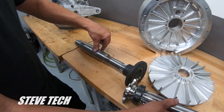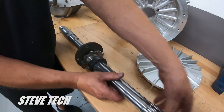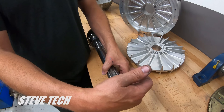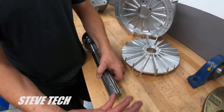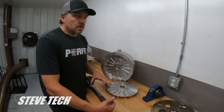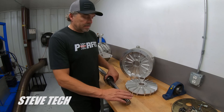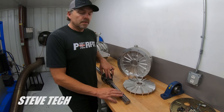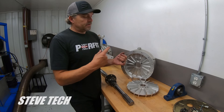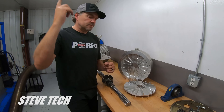So this is where the rotor goes. The rotor goes here, bearings right there, and then this basically goes here, and there's a flex plate right in the way. Then on the motor side, we don't just run a regular flywheel on the dyno. We actually run a spring-loaded plate, so real similar to a clutch plate — in fact, it basically is a really overrated clutch plate. No slippage or anything, but that spring-loaded center absorbs the harmonics from transmitting through the shaft, because those harmonics break stuff and add to a lot of problems. I have been using this style spline shaft for a few years now because after breaking drive shafts, breaking U-joints, sending drive shafts through the ceiling, through the truss, and through the roof of one of my shops, I stopped using those things.